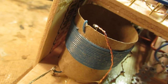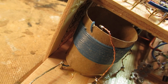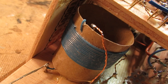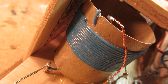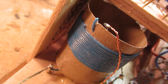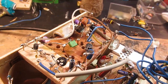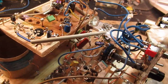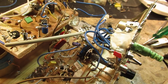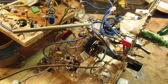And of course, I had many shortwave coils, and then I mean antenna coils, in store, and in the past I've made many radios with such a tank circuit antenna coil for shortwave. Anyway, let's listen. Of course, with such a setup, that's a TRF setup, so not a superheterodyne setup, the selectivity is always a problem.